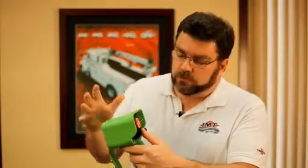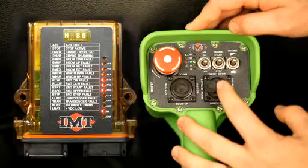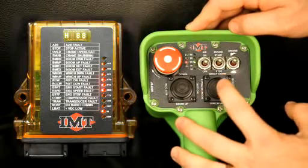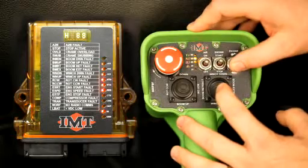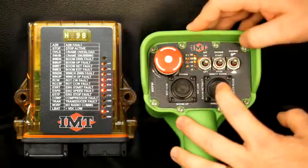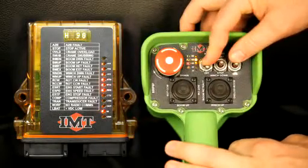The same procedure as low — you go through. You want to change something, go higher or lower right here. Once you get the number you want, you continue to hold that function, then hit engine start. You'll see the red LED come on — that's saved. If you want to go back to low, you forgot a number, just hit the low, or air off and the low. Now you're in low side.